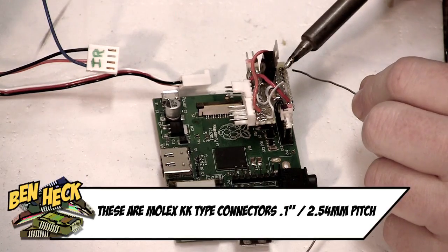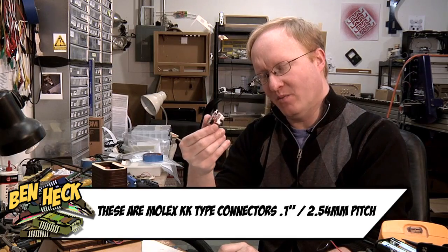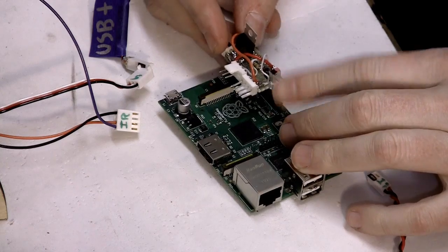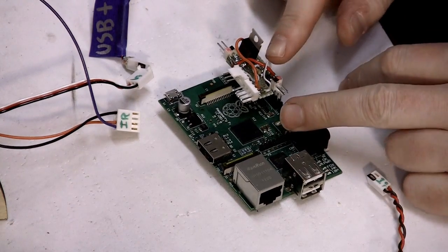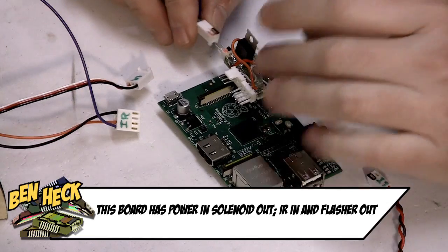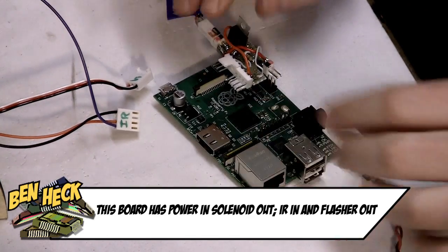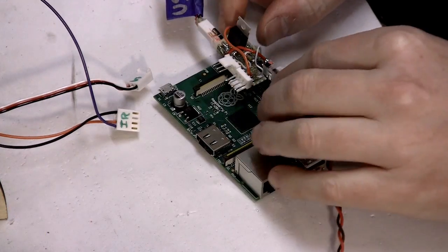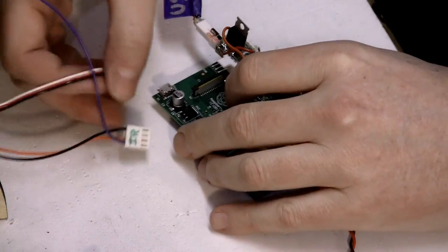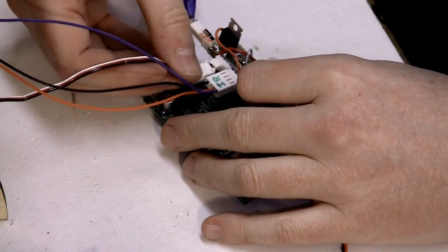So, what we're going to do now is make an adapter and hook up the wires from the servo and the IR to this Raspberry Pi. Here is the breakout board that I made, and it plugs right into the Raspberry Pi like so. It has the wiring on it as well as the TIP-102. We need external 5 volts here because we don't want to run the servo off the Pi's power. We're going to attach our flasher here using a pinball flasher. Our IR sensor goes here, and our servo goes here.